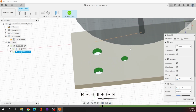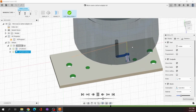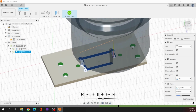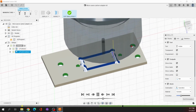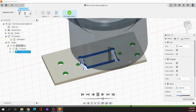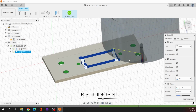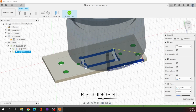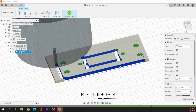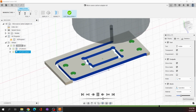All of this will be done underwater. You do not want to inhale carbon fiber dust. That would be a very bad experience and potentially could lead to long-term damage to your lungs and your respiratory system. So we want to avoid that and stay healthy. And I will show you the setup that I do for machining this part underwater very safely. No need for any respiratory protection, no need for a vacuum cleaner, nothing like that.